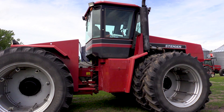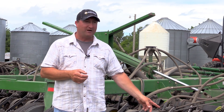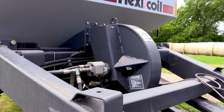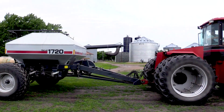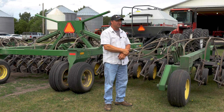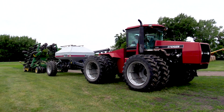We had to put another valve on this tractor. We need to run about 1,250 pounds of down pressure on these discs. When we're going in the field seeding alfalfa or putting on fertilizer, these back wheels are off the ground — they're always off the ground. This tractor barely had enough hydraulic capacity, especially running the fan at 5,000 RPM for fertilizer delivery plus 1,250 pounds for down pressure on the drill. It maxed out the hydraulic capacity of this older tractor, but through some modifications we made that work too. This tractor is a 1991 model and it's set up now to handle a drill of this size just fine. The myth that you need a new tractor with new-style hydraulics to run this isn't true. We're doing it with an old tractor that's 30 years old.